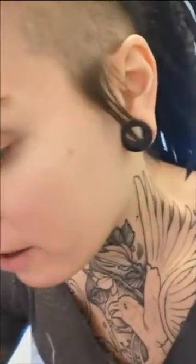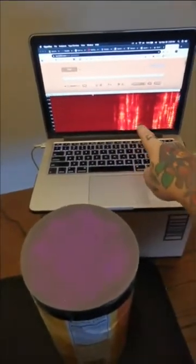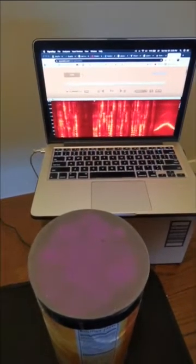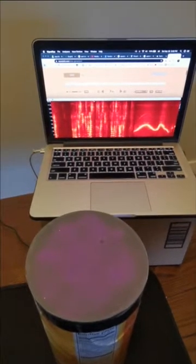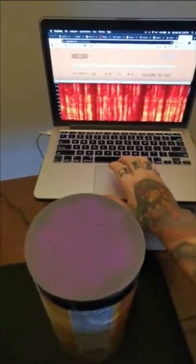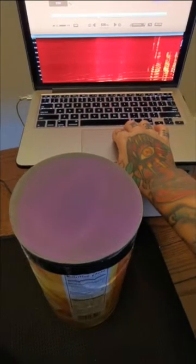So I found a way around my issue of not being able to show you the analyzer at the same time as the mode shapes — I just switched it around. I'm going to play the sound from the computer but also measure it with the computer and I can still use my phone. You can actually see my voice here when I speak. You can also whistle, you can draw pictures. I'm back to about 30% volume. That's the first mode at about 320 Hz.